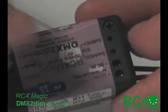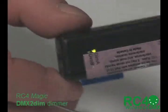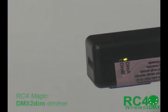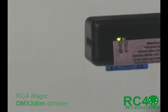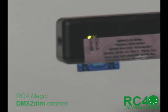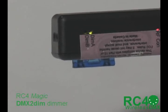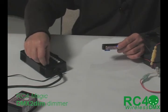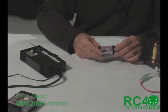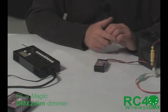There's set A and set B. With a little tool — in this case the end of a bent paper clip — I push the set A button momentarily. That has assigned that dimmer: the light is on and it remembers that setting forever after. Channel B is still set to the first DMX channel from when I powered it on. Now dimmer A is set to channel three. It's non-volatile memory — you can do this setup once at the beginning of a production and never have to touch it again. It lets you set any DMX channel to any dimmer; they don't have to be contiguous channels, and it's very easy to do.